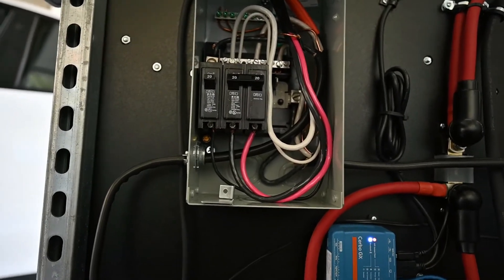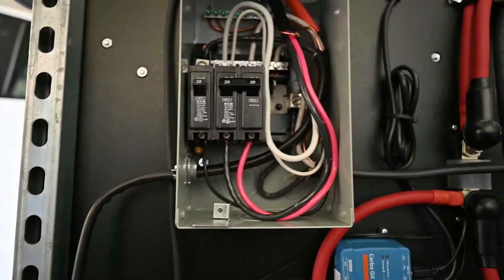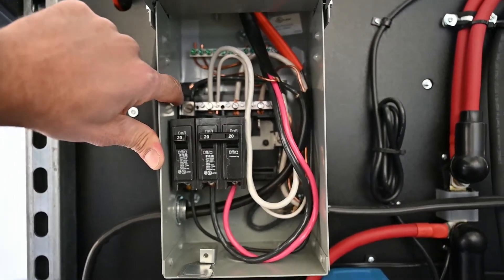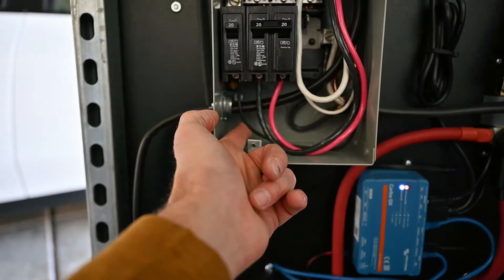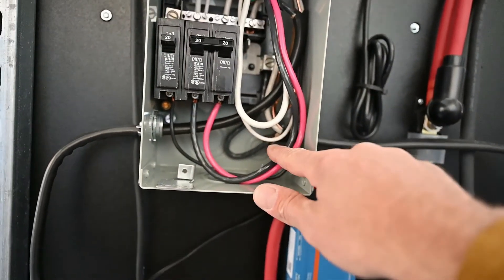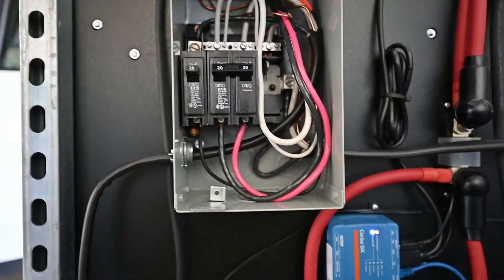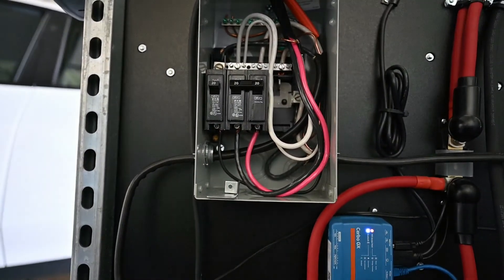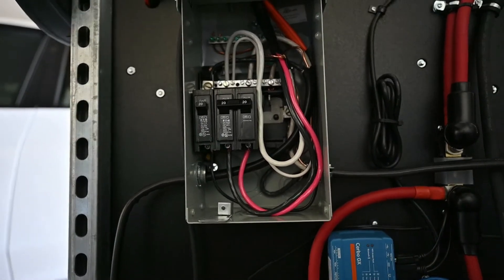For the 120-volt circuit, I have it tied to the left-side inverter. The hot terminal is coming in here and attaches to the pin on top of that circuit breaker. This is the hot lead for the 120, along with a neutral line and an additional ground. All this cabling is extra-thick 6-gauge, just to minimize any voltage drop. The 120 is a simple 20-amp circuit — it's only running a fan. The wiring is similar to what you have in your house, but a little bit beefed up.